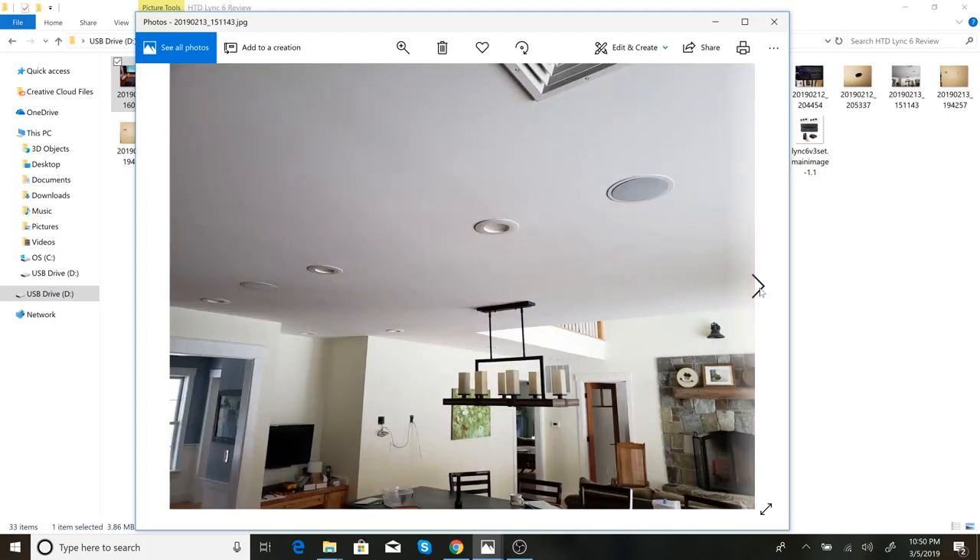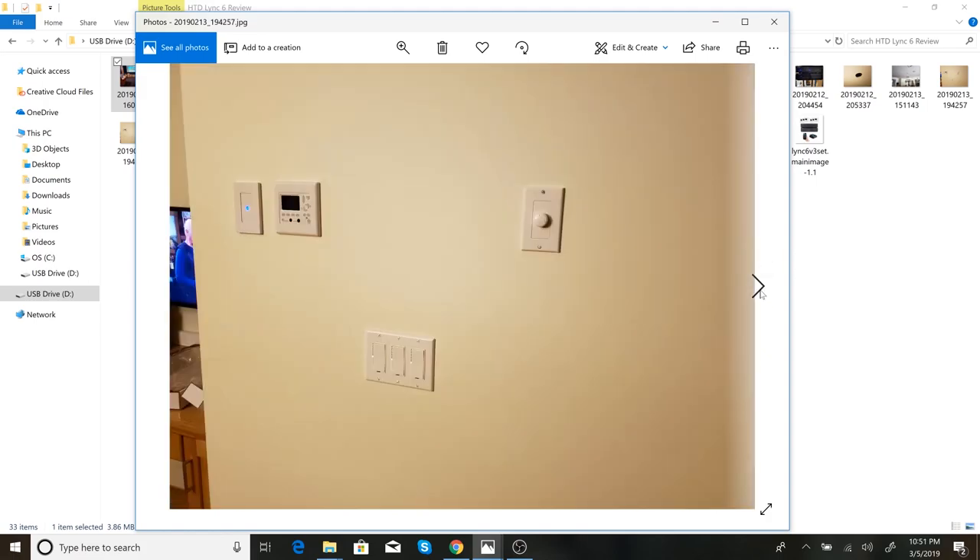Here are the speakers installed in the kitchen — this kind of shows you the open concept I was talking about. There's another set of speakers over in the living room that you can't see, and obviously you wouldn't want to be playing two separate zones there — it'd be kind of chaotic. So this is the volume control for those. I can control them separately. You can see the speakers installed, and I'm using the compression grills. If you used the other style grill, you wouldn't see the little white ring around it — you'd just see the grill. Here's everything installed: the volume control for the living room, the keypad for the kitchen/living room zone, and the Bluetooth input panel.